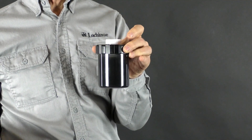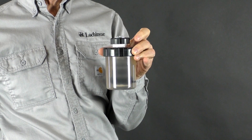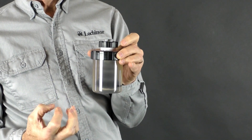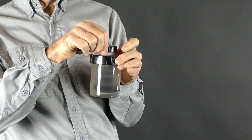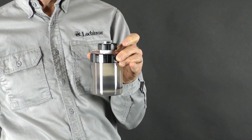When you open up your old boiler for replacement, a lot of times you're going to see water that looks like this. What it has in it is magnetite or iron oxides, which are bad for water quality. With magnetic technology, I slipped the magnet into this jar — you can see all the magnetite is adhered to the magnet, which we can get rid of out of the system. Without the magnet, versus with the magnet.